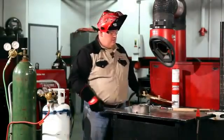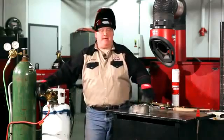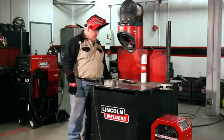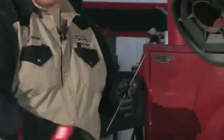As you noticed, I kept checking the casting in different areas to make sure the heat is localized and that everything is going into the casting at an even rate. I have my welder set at 85 amps on DC positive, and I am running the 1/8th nickel 55 soft weld electrode.